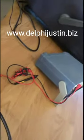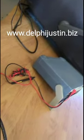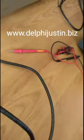The times one is basically what connects it directly through. I remember watching one video from Glass Linger who explained that when he was fixing a TV, I think, he said to use a times 10 probe on it, because you're measuring high voltages. When you're measuring the tubes, you want to make sure you can handle the higher voltage. I don't know if this scope can do that. I don't know if the tube voltage might go higher than 400 volts, or whatever this oscilloscope is rated for on the inputs.